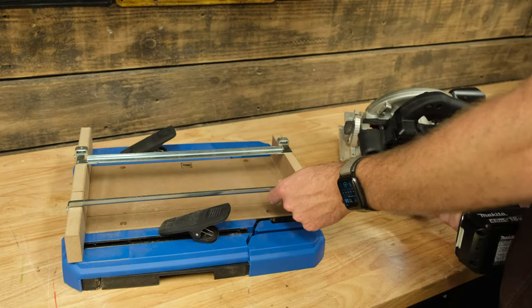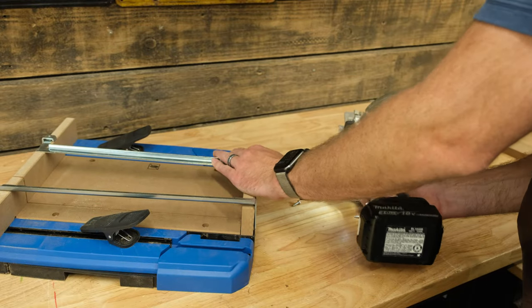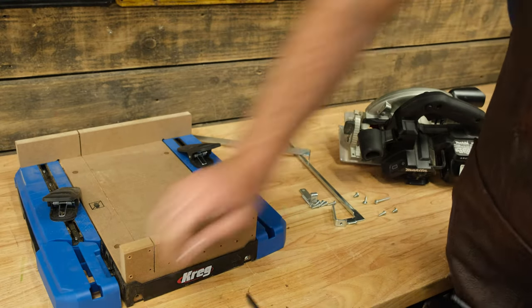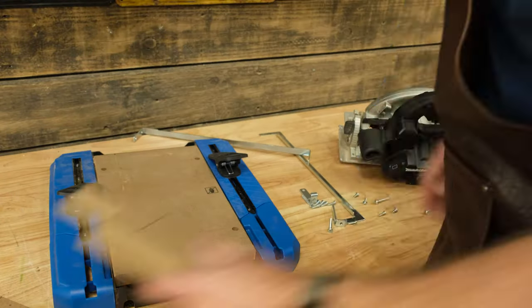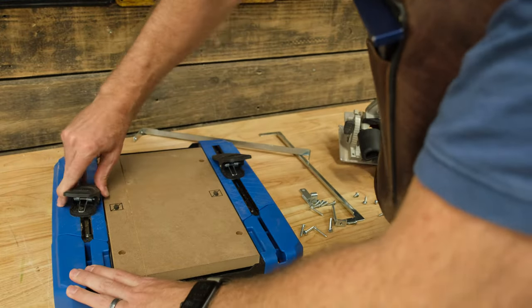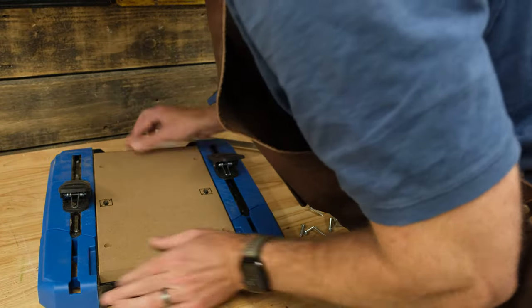The assembly for this is very sturdy, but first we're going to disassemble it because I already have my curve cut in here. I'm going to take off these rails that fit the shoe very nicely — they adjust to whatever circular saw you have. Then we're going to take out these bottom screws in the MDF and pull out these pieces and swap new ones in. I want to line up everything in my curve cut correctly, so I'm going to swap this one out, put the new one in.